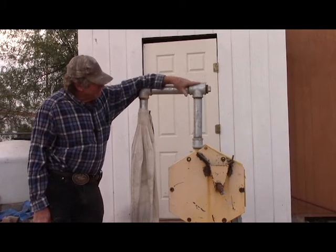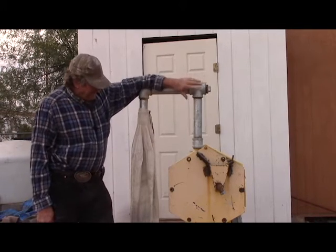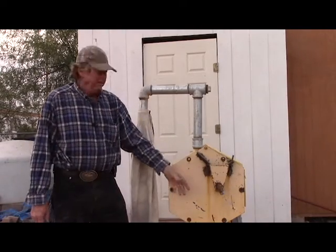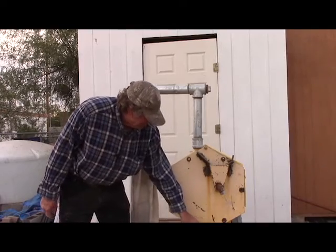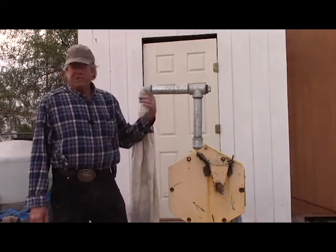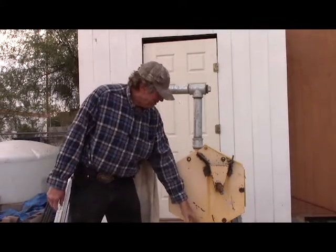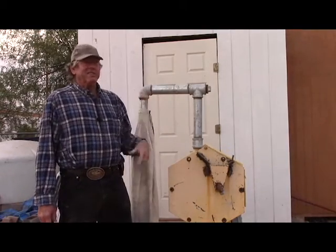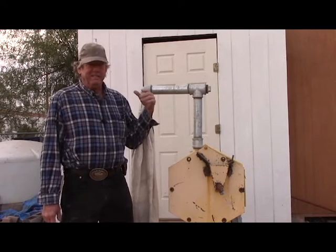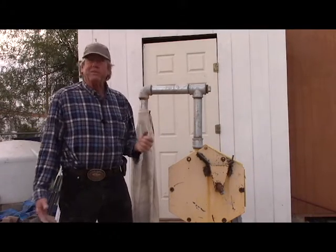This is our Action Mining impact mill which I had in a previous video, and it has two exits. You have a lower exit here — if you were wet grinding you'd use that one, and you typically put some kind of screen there to keep larger particles in the mill until they got smashed up. However, because it's at the low spot it tends to let things out real quick, and you get a wide particle size range and fairly coarse too.